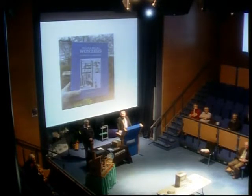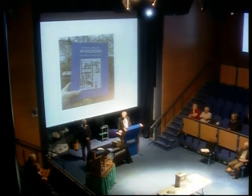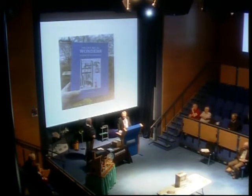And the third thing is the cylinder and piston that you showed of the Ingestry engine, which was in the Science Museum and is now back in the Science Museum stores, I think. It shows what Richard Trevithick was up against with high-pressure steam and no means of sealing it, the very long piston, which simply had to be wound around with tallowed rope to seal it. I've got an admission to make here, the seal is PTFE, but if I hadn't told you that, you would never have known.